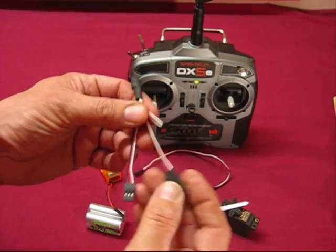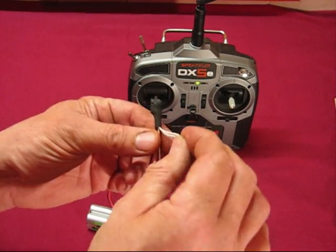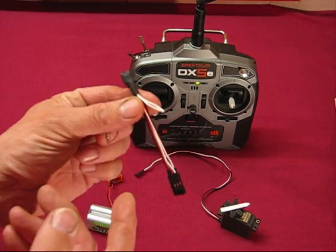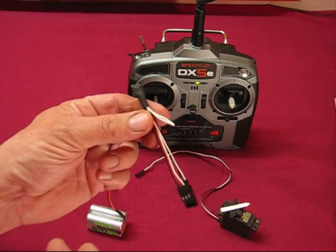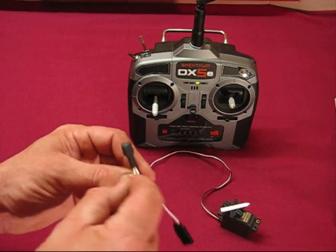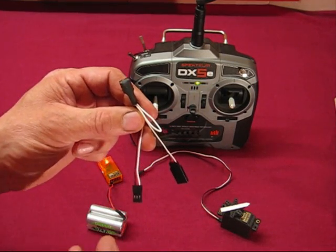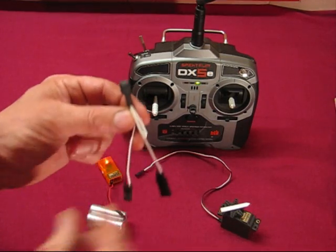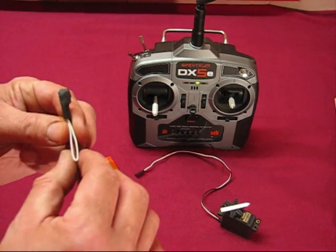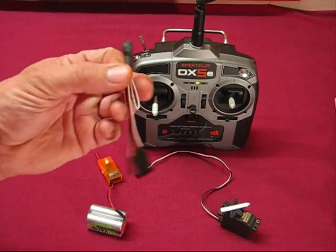This is the adapter itself: a plug to the receiver's auxiliary channel and a socket for the servo. This loop of wire is for reversing the servo. On an installation you're unlikely to need to constantly reverse the servo — it's something that happens once. If it happens to be the wrong way, you just cut that wire and it reverses the servo. It's a simple way of reversing the servo without the weight of a switch, ideal for a one-off reversal.